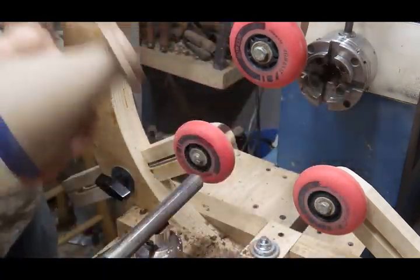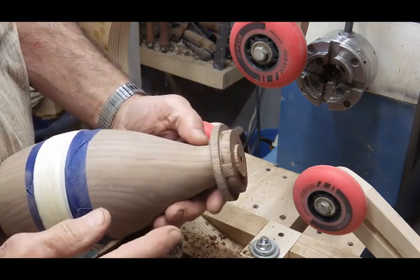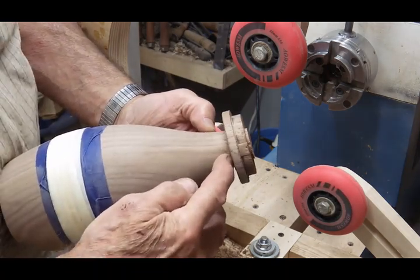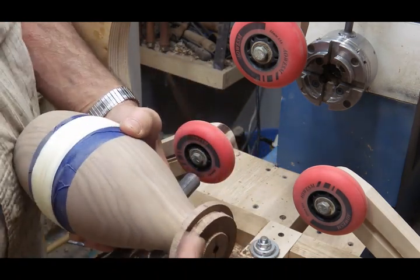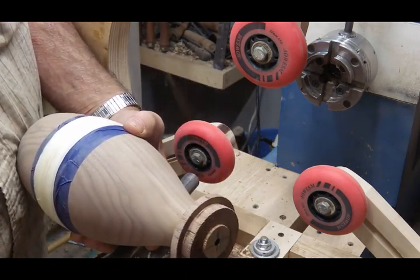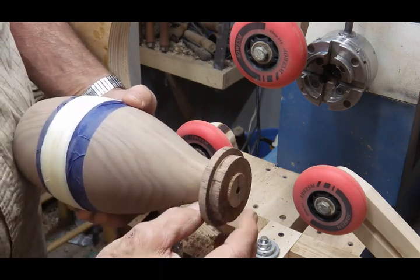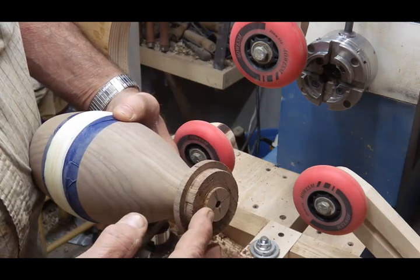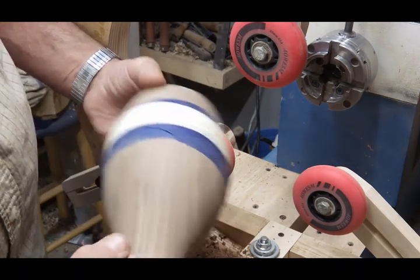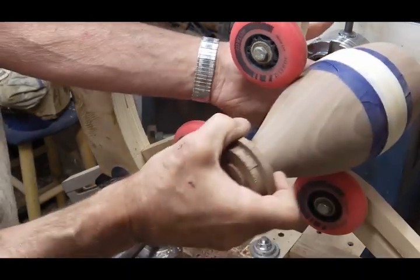Okay, now this is going to be a vase. Don't chop it off right here when you get it turned around and you start working. Take your lip, your tenon, everything, and taper it down so you have a longer neck. Don't waste the wood. That way you've extended the neck.